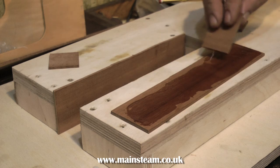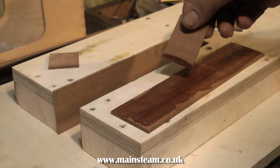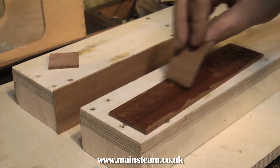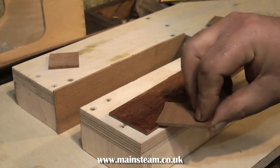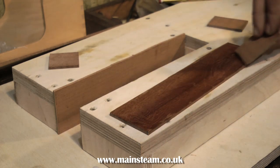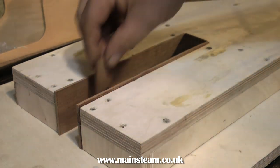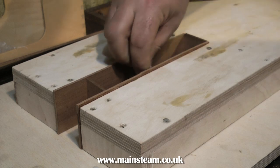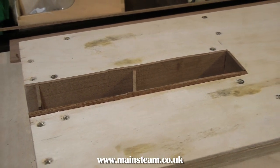The whole point of making this solid base — and it really is solid out of this thick plywood — is that the engine will not resonate too much on it, and the base will not warp over time, which would cause problems with the engine. Don't go too mad with the adhesive though; you don't want to get it all over the place. Working with cyano is an acquired taste. I do it all the time and I'm very used to the speed at which this stuff grabs. You only get it wrong once, and if you do get it wrong, it's quite difficult to get the piece of wood off without using a chisel. The good thing about cyano is that it grabs quickly, but it's quite important to make sure that you have something to press it in place. Here I'm using some scrap pieces of mahogany as spacers, which hold the mahogany tightly against the plywood, and the cyano will grab very quickly, so in no time at all we can carry on with the next bit, which is planking the top.